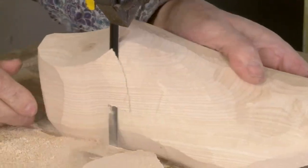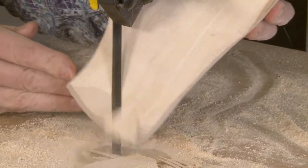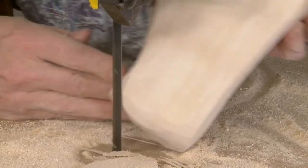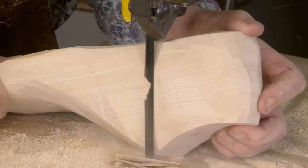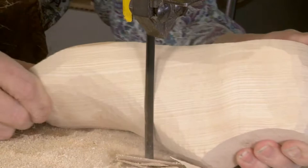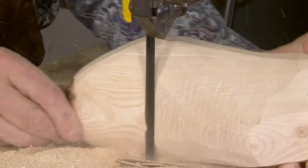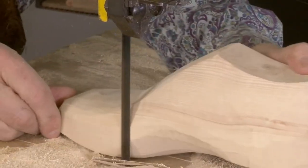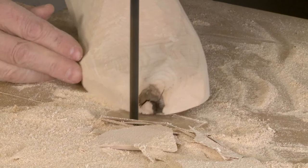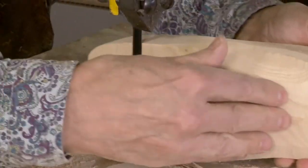And so that's the trick, to learn to move the wood through in smooth flowing shapes that create contours, and only taking off 1 or 2 millimeters at a time. You've got plenty of time, it's fast, you just keep moving. And it's effortless. You don't let the blade do any work other than just remove the surface of the wood. And that way, gradually the shape emerges.